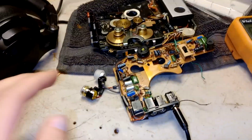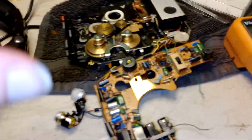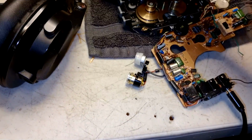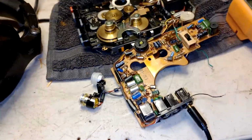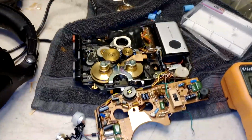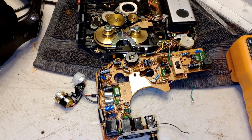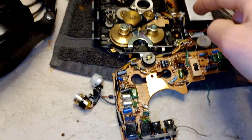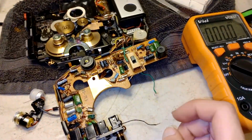I know my ABCs. Well, let this be a lesson to you. Change your batteries. The reason why this amp has been so weak and why this feature hasn't been working, the Q function, is because the batteries were weak. There were three batteries completely dead. With no amount of voltage on those batteries, I'm surprised this did anything. Must be energy efficient with batteries or something.